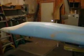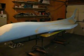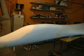It's 18 foot long and I think my two turbine ideas are out the window. But anyway, we got us some glass and some resin on the way. I got it all filled and it's ready to glass. What we're going to do is put two layers of 9-ounce tooling cloth on this. I'm going to get it all primed and get it all real smooth. Then I'm going to come in here and put on my panel lines and make it look as scale as we can.